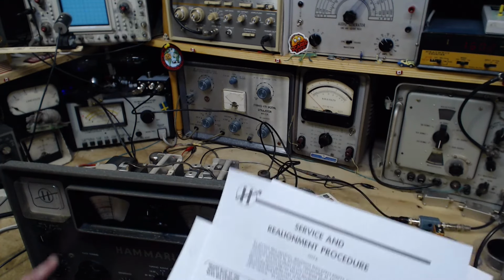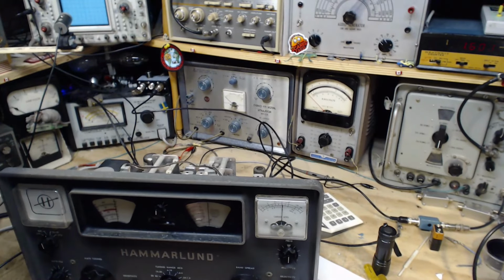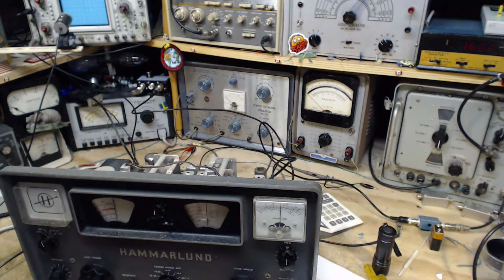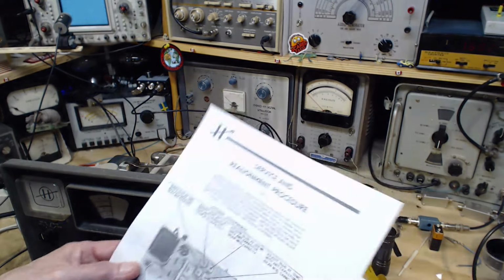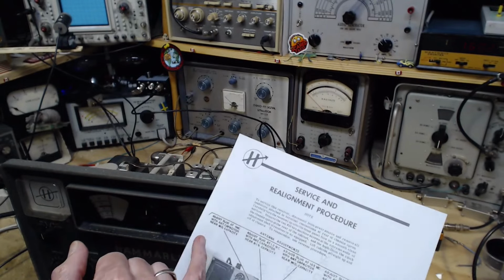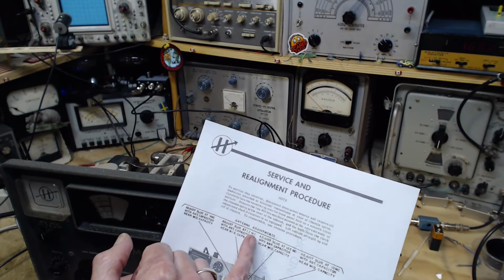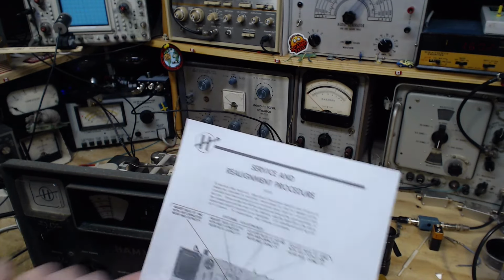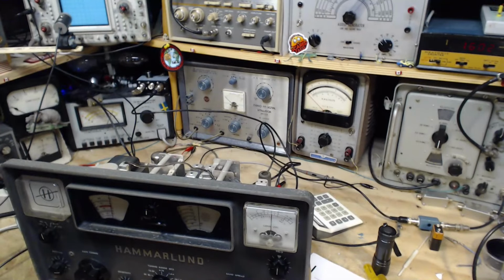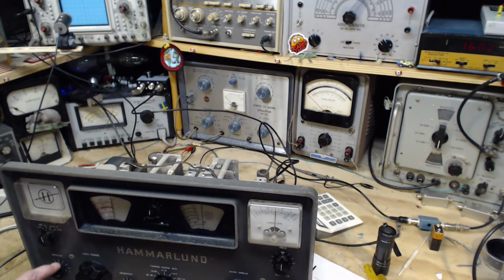They must mean the antenna trimmer, which I cannot see without looking underneath the radio. Oh, okay, let's read that again. Adjust slug at 1.2 megacycles with antenna capacitor near minimum capacity. And I have to see it. I don't know where the minimum is. Maybe I can train myself. Calibrate this front dial here.